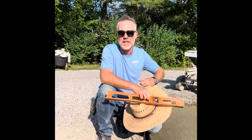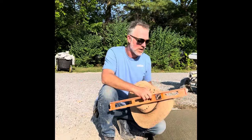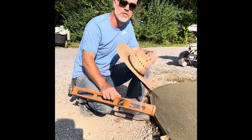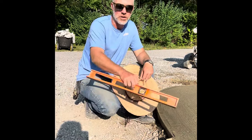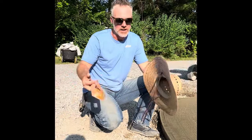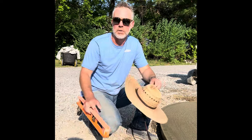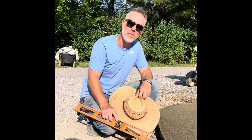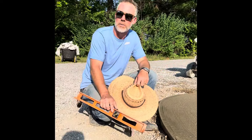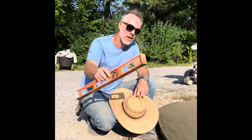This is a total do-it-yourself project — we used a broken level for a screed and I'm just putting a little edge on here with a leftover tool. Couldn't find a couple of the usual handy tools for a project like this, but bottom line we got $250 in bags of Sacrete, about a day chopping up the ground and getting everything put together. For a few hundred bucks I think it was well worth it. The mud mixer got a thumbs up from everybody, including Blake — he was on a concrete crew for about a year and a half and said it was super handy, way better than bucket mixing or using a tumbler.